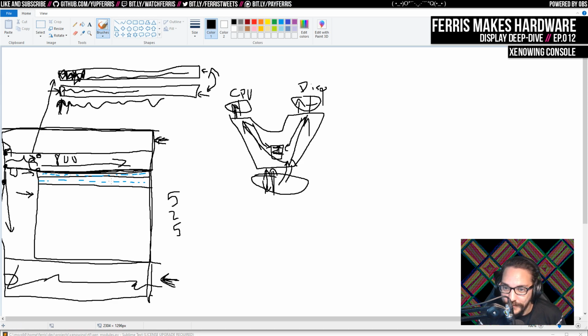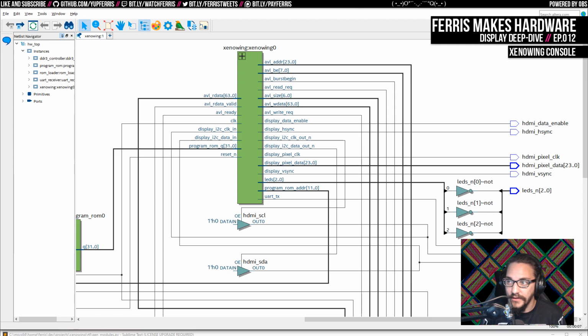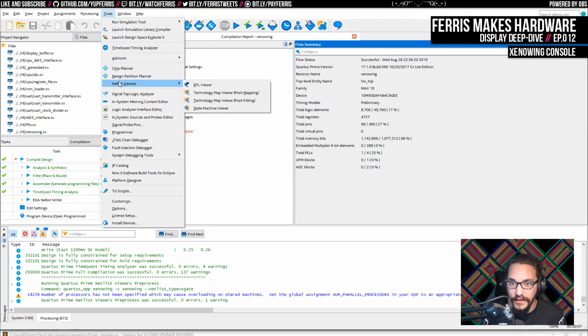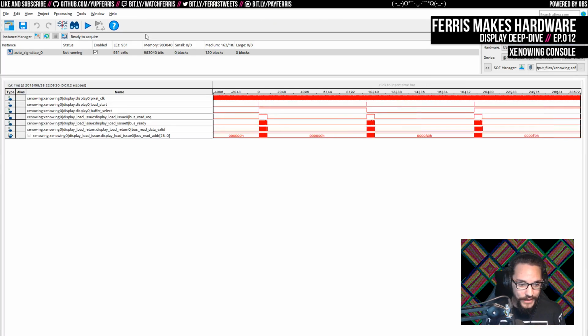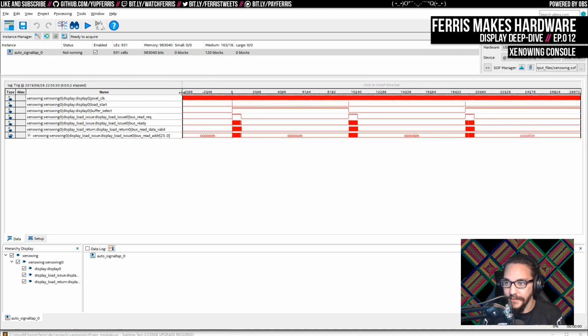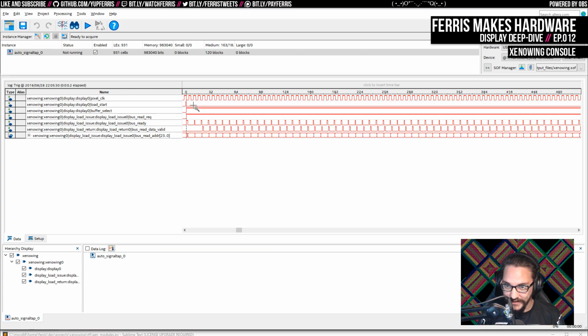Anyway, so that's mostly how this works. But here's what I'm thinking. Now that this is implemented, we can actually look at some traces that I got here. So if we go to record this again, I'm going to open up the Signal Tap. This again is our baked-in logic analyzer. So I tapped onto the bus here. We can see a bunch of different things because I was debugging here. So here's our pixel clock outputting pixels, and it's going to be 4 pixels per data word.